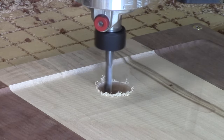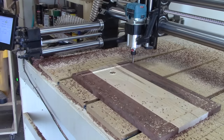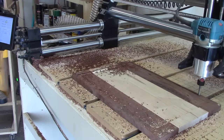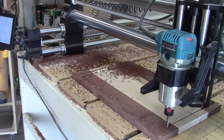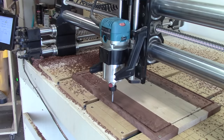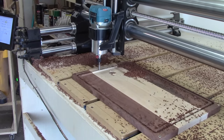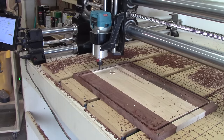The final step of cutting this out is going to create the profile. I always like to do that profile last, so when the bowl bit is doing its cutting it's going to have the maximum amount of hold, and there's very little chance of anything breaking loose. If you were to do your profile first, then you run into a higher likelihood of your work piece breaking off.